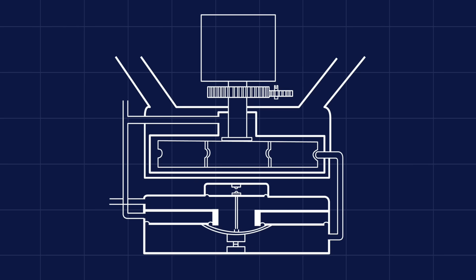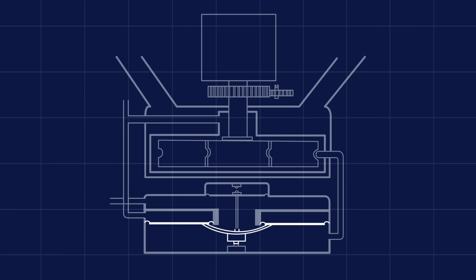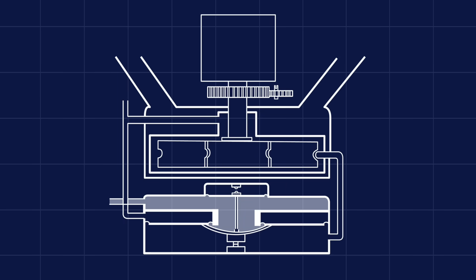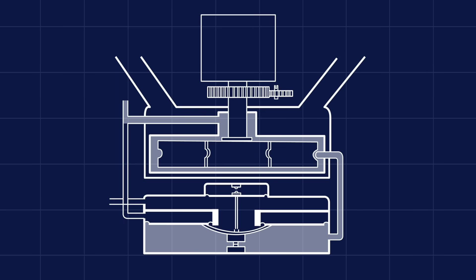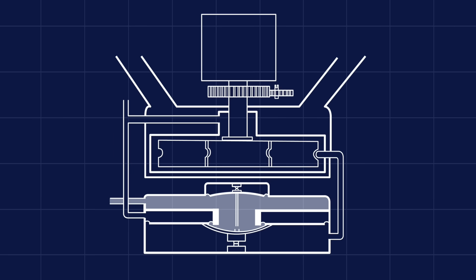To show how this all works, let's have a look at a cross-section diagram. Here we can see our fan surrounded by the cooling plenum, and our upper low-speed and lower high-speed diaphragms, which divide the internal space into three compartments. Pitot pressure is fed into the upper compartment, static pressure into the middle, and fan pressure into the lower compartment. The upper low-speed diaphragm prevents the AMU and API from operating and producing spurious readings while the aircraft is taxiing on the ground. The attached contacts sit between the fan motor and its power supply and are normally open. When the aircraft makes its takeoff run and reaches an airspeed of 50 to 70 knots, the diaphragm is deflected and the contacts close, turning on the motor and activating the AMU.